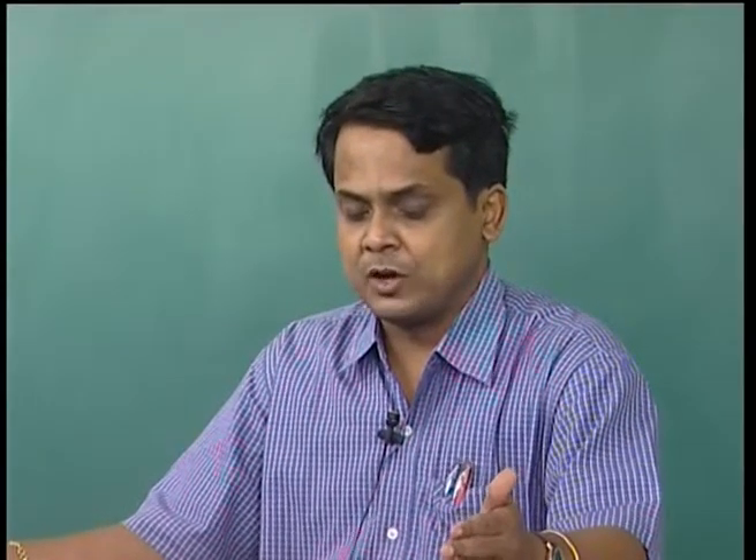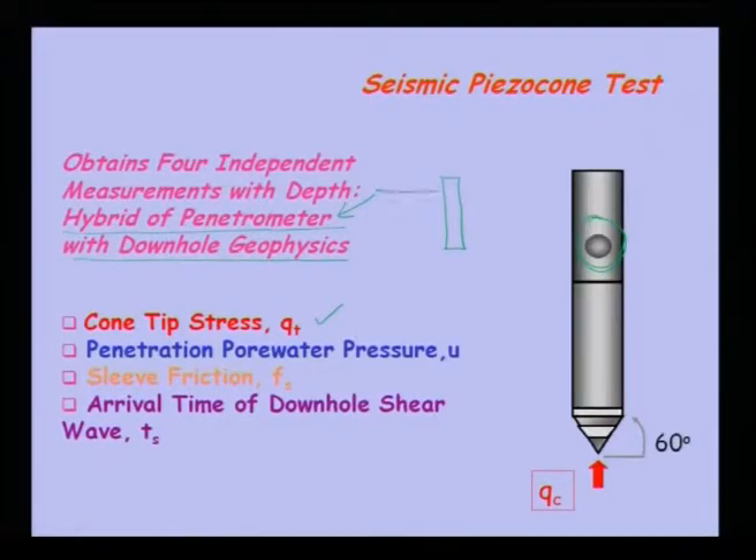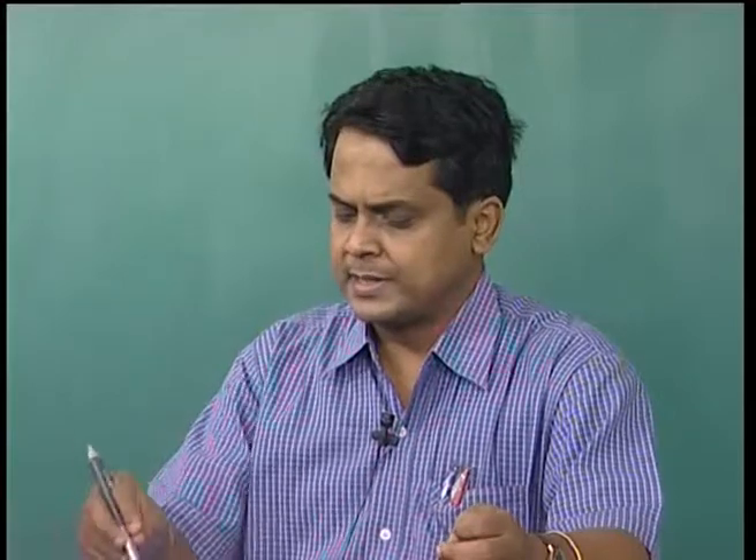This is a mixture or hybrid of a penetrometer; earlier it was a cone penetrometer with a downhole technique. An arrangement was made where geophones were provided in the cone. The first of the 4 independent measurements is cone tip resistance. Cone tip resistance is required particularly for pile foundation design — you need to know what the tip resistance of the pile is, so cone tip resistance measurement is essential.